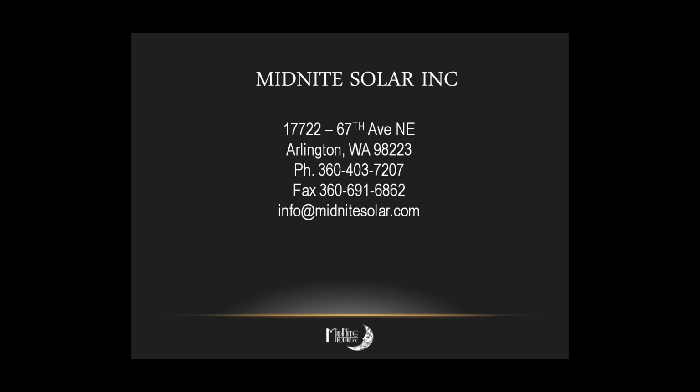And as far as for battery sizing goes, let's see, you've got the 520 amp hours. Do you size with a certain amount of depth of discharge in mind? Like, talking to Justin here, 50% is about where the standard is, right? Yep, that's good. All right, so you actually have 260 amp hours usable, and so it actually looks to me like if you're at 72 amp hours or so, you're looking at a little bit more than 3 days of autonomy, and it sounds really good, actually.